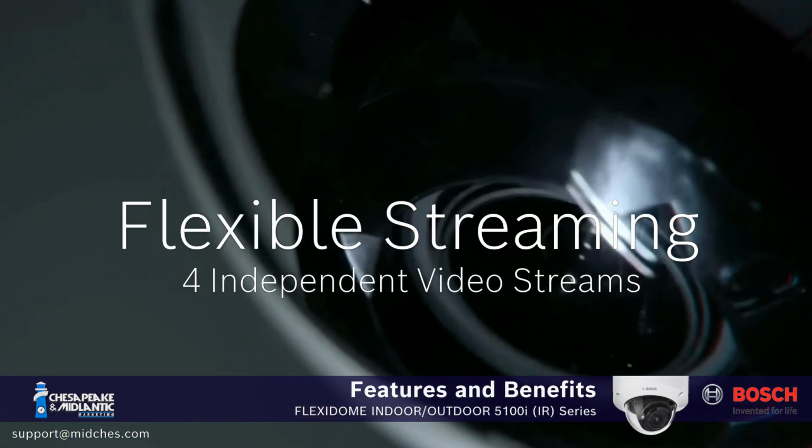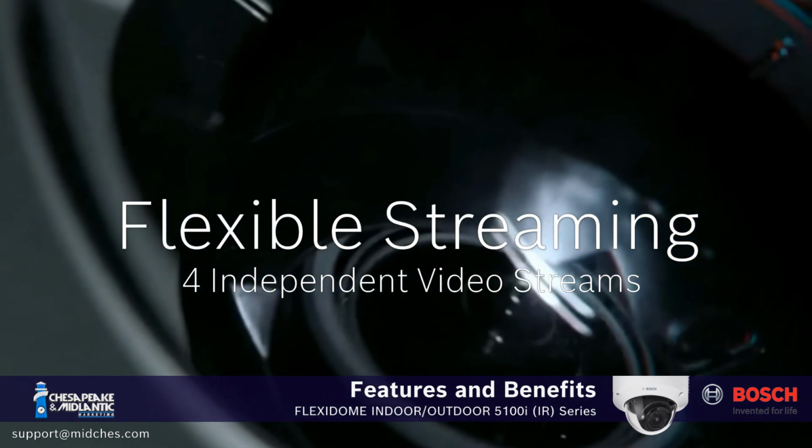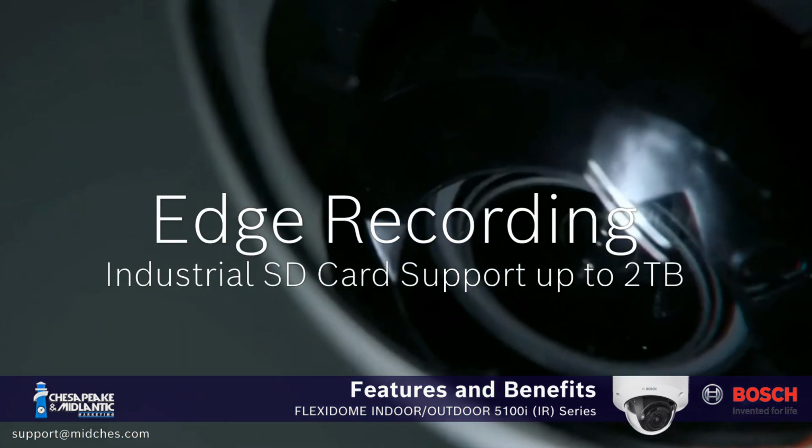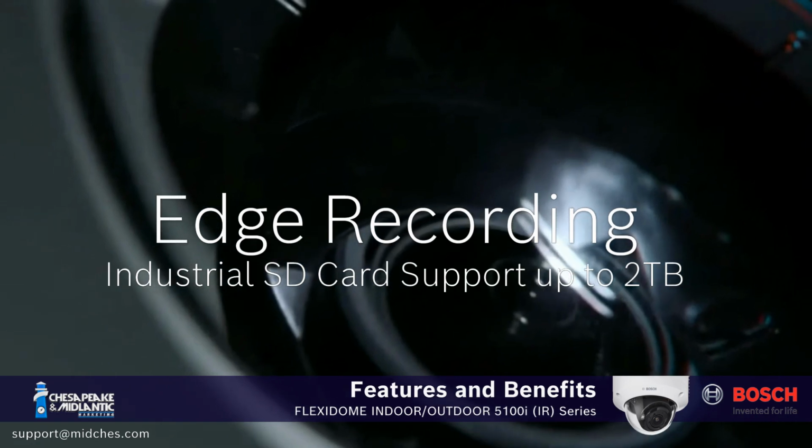Independent video streams, as we know, you could have a low speed stream. You need a low speed connection for, let's say, a 5G or 4G type connection for remote monitoring. That could be one stream. You have a stream for a local live view that you want to be better resolution and higher frame rate. And then, of course, you can have a separate stream for recording the information. And the last one that I covered was that micro SD card capability.